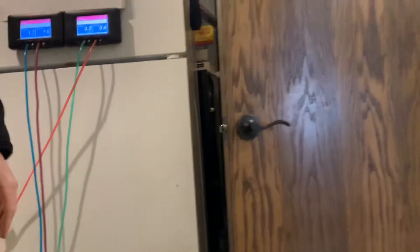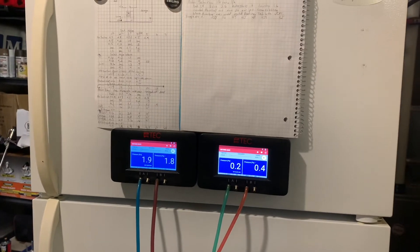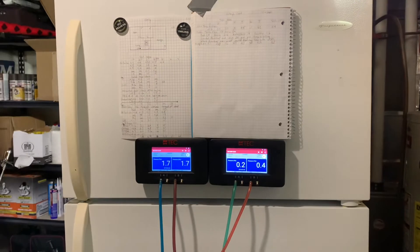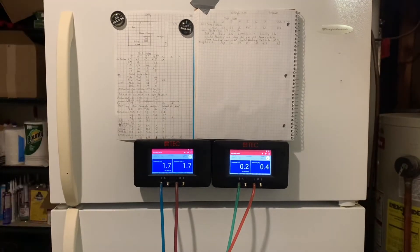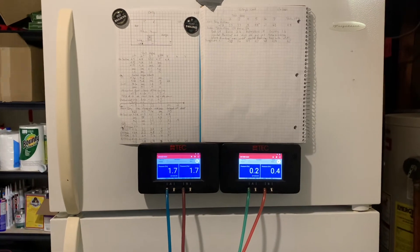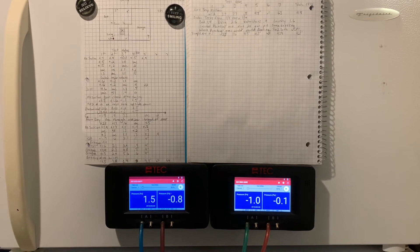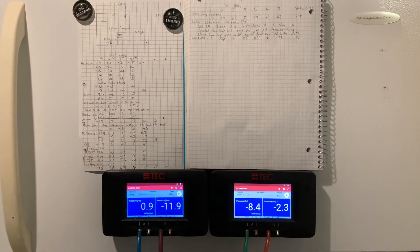We're probably moving — I haven't measured — but probably between 20 and 30 CFM with this current setup. You can see when I shut the radon fan off the numbers are going positive. I'll put this duct tape cover back on and turn that fan back on to show you what happens. You'll see those numbers start to go down — I just turned the radon fan on.